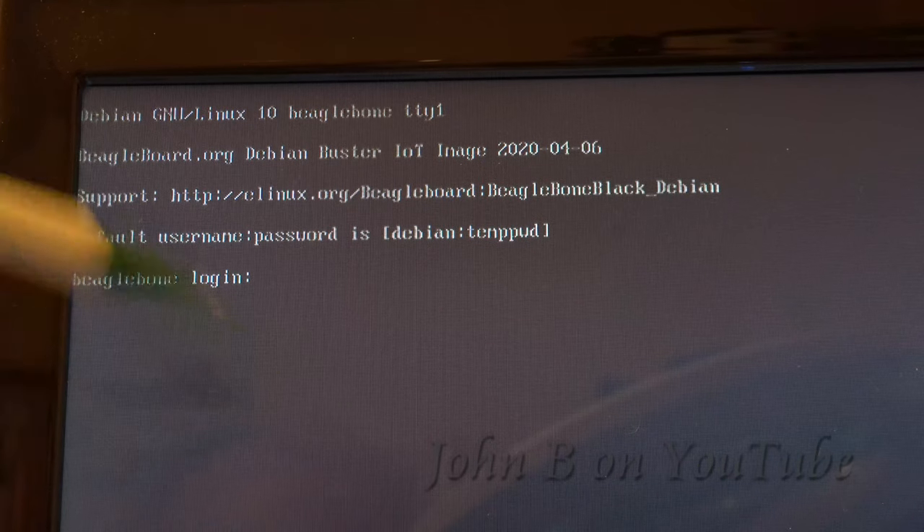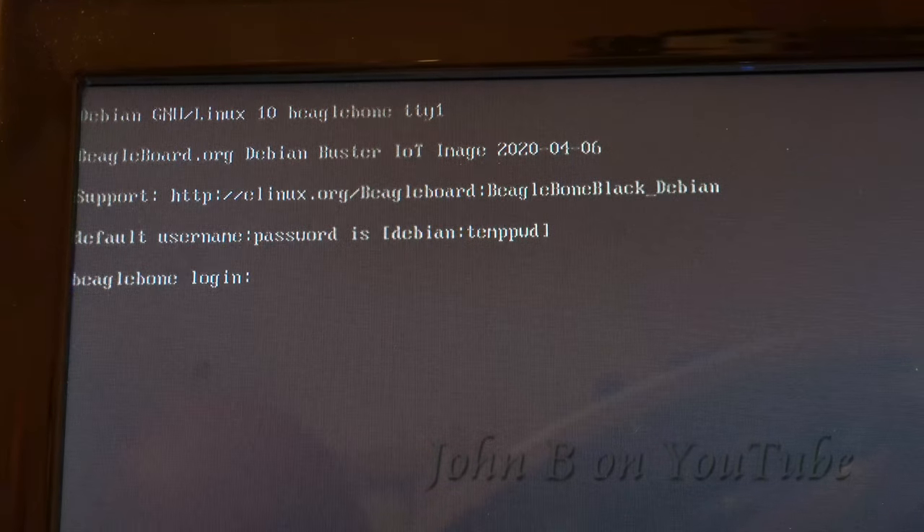This TV was given to me — I'll just use it on the security system upstairs. I've plugged the BeagleBone Black Wireless into it and you get a little Linux logo, the penguin — Tux I believe his name is — and then the login for your BeagleBone. I haven't got screen capture for this Alba TV, so let me start from the beginning. You've got to configure those two pins, P9.24 and P9.26, for CAN.